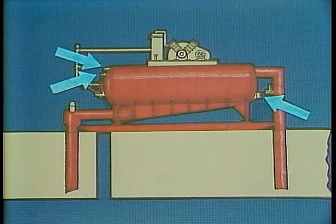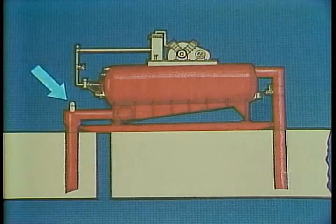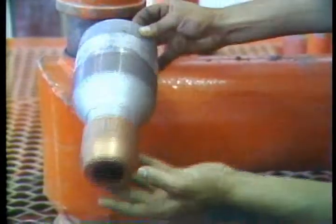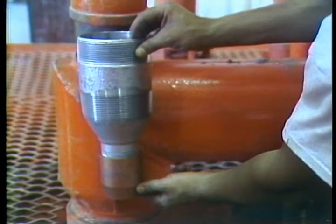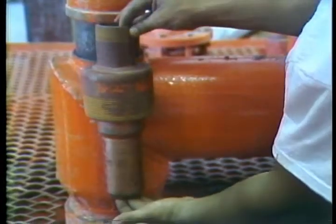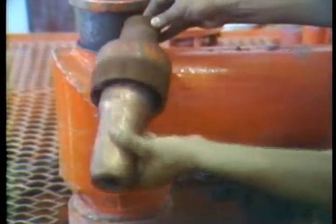These three wash ports are open when you want to flush the unit out. The discharge line can be hooked up to either of three ports depending on where your mud pit is. The jet nozzle is placed here on the discharge line, and you have your choice of two nozzles depending on what kind of pump you're using. A one-and-a-half inch nozzle would be used with a centrifugal pump — it should deliver about 40 psi minimum pressure. If you're using a piston pump, you'll want to use a five-eighths inch nozzle, and that'll require 250 psi minimum pressure.